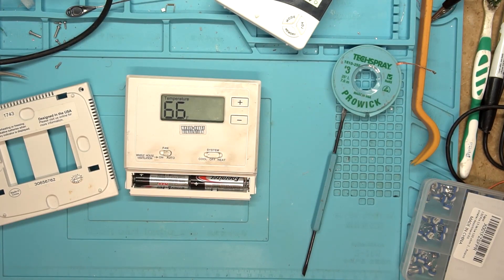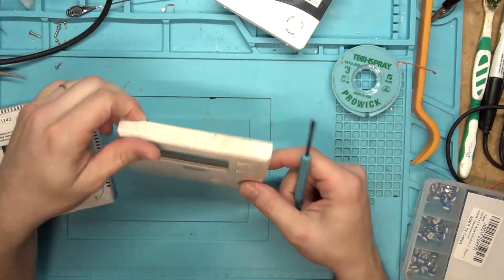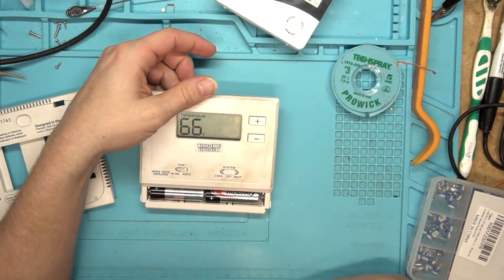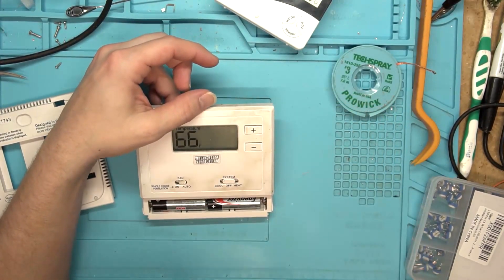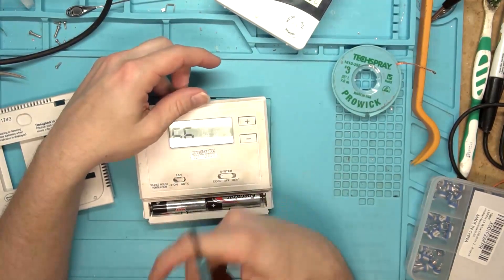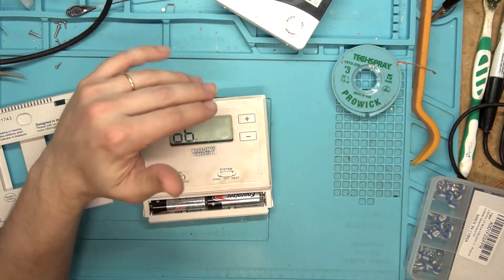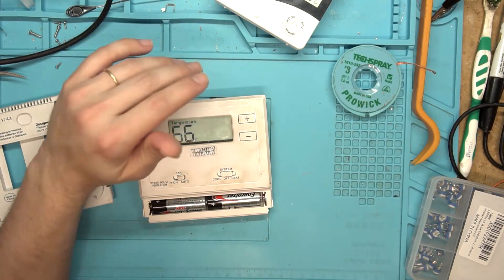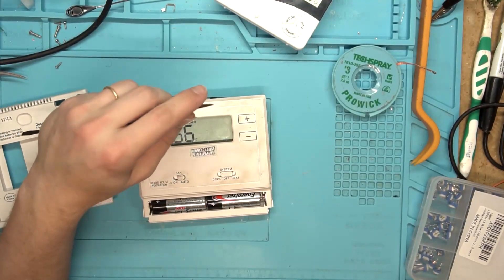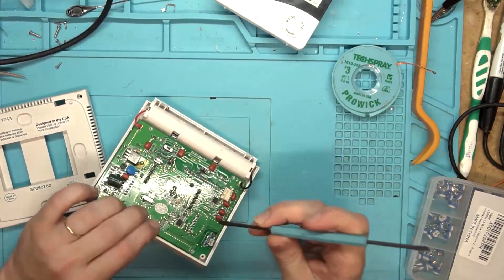I stuck the circuit board in front of the fan for about two or three minutes to cool it down. Pretty sure it was set low since it was reading pretty close to correct even though I knew the whole circuit board was hot. Let's adjust that a little bit. We'll just keep adjusting it until we get to 70 degrees. There is a delay between each adjustment and it registering on the screen - like anti-slosh on a gas tank instrument cluster - it keeps it from jumping up and down. You just slowly adjust it until you get it to the right temperature. I'm going to give it a bit of time and keep adjusting it off camera until I get it set.